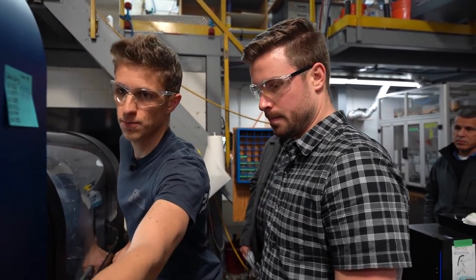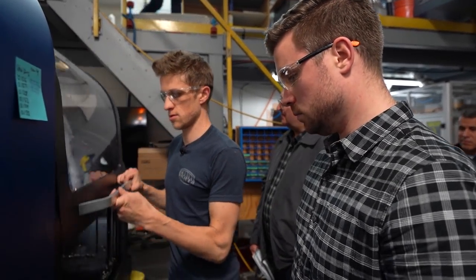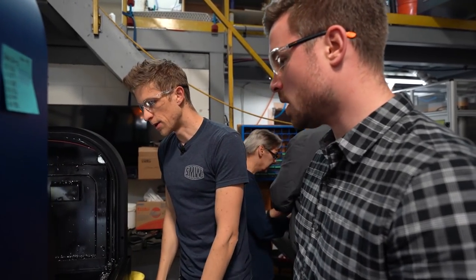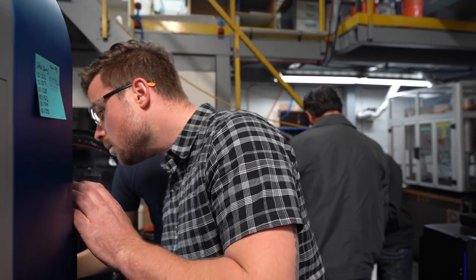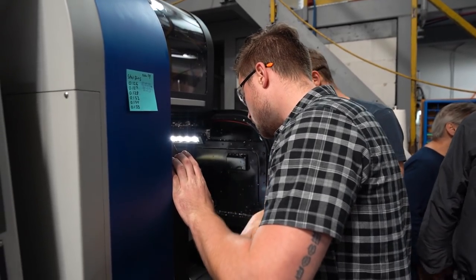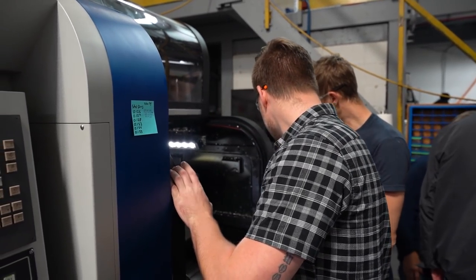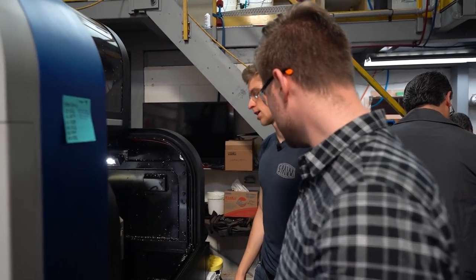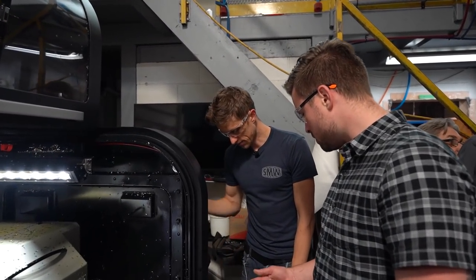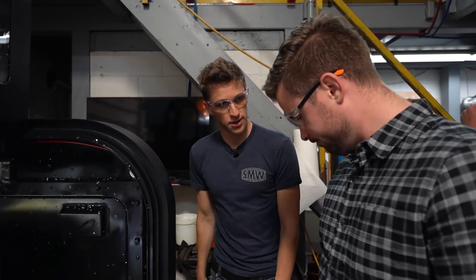Yeah, so let's open this up here. So you see the drips, just everything drips on you. But yeah, the subspindle comes in, grabs it, spits it into this chute. Okay. And then there's a conveyor here. We invented that parts carousel, which is epic. So after X number of parts, we'll rotate. You got your rotation right there.